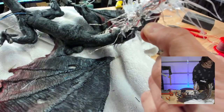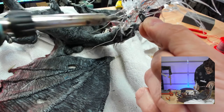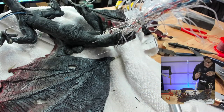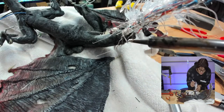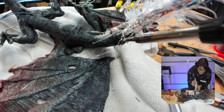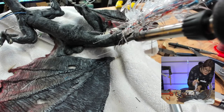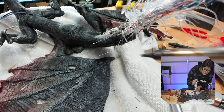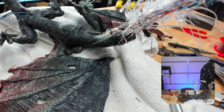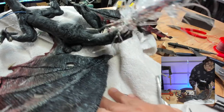All right, let me see if I can hold this in place and nearly just shrink up here. Ooh. Shrink away, come on. Shrink enough. Yep, here we go. Maybe shrunk enough. And normally I like the heat shrink nice and tight against the wire, but right now, I'm not being super picky, because it's more just to prevent touching, not so much to prevent environmental elements and all that stuff. So, now we have a nice little lead here that we can continue working on.